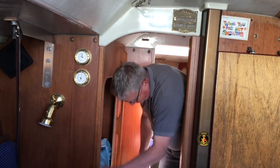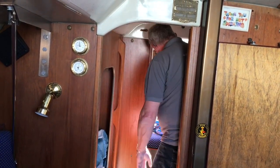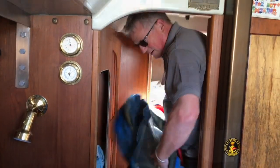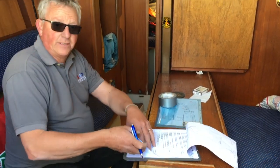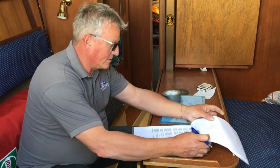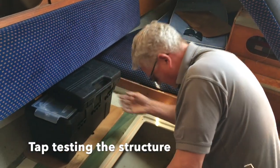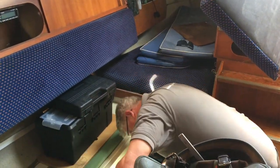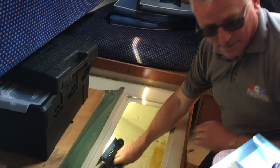When you're doing a pre-purchase survey, it's always nice if people actually empty the lockers. Here I've got about three years' supply of sails and life jackets and other gear. Surveying is like a journey - every time I do it, I always try and do it in an order. That way, when you go to write the report later, it's all good. Just looking for structure, making sure everything's glassed in and bolted in as it should be.